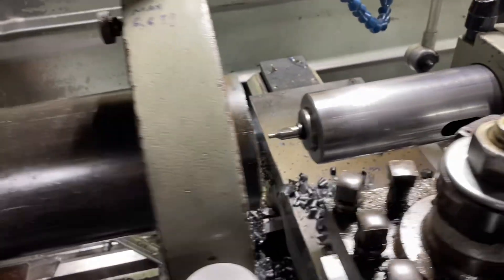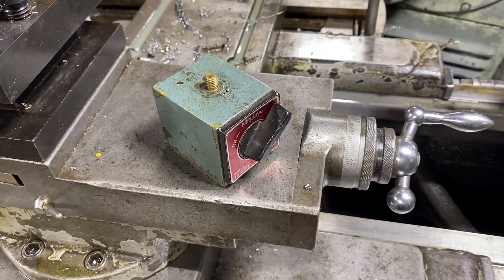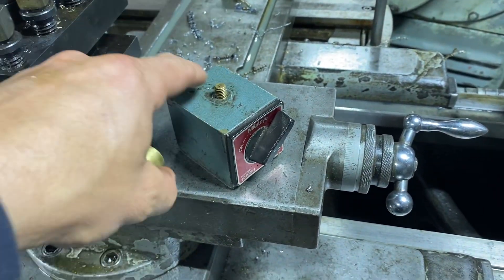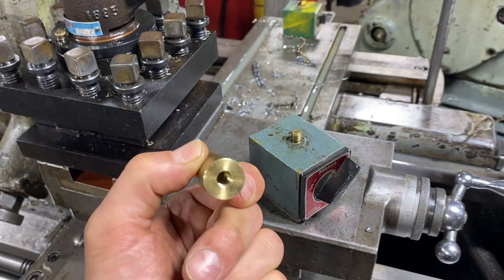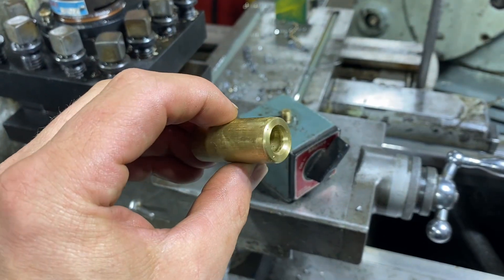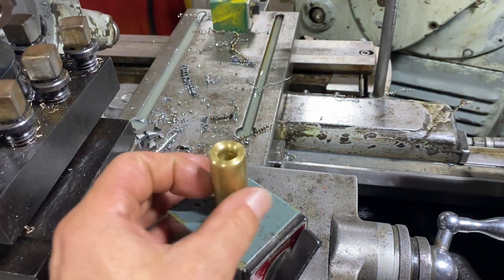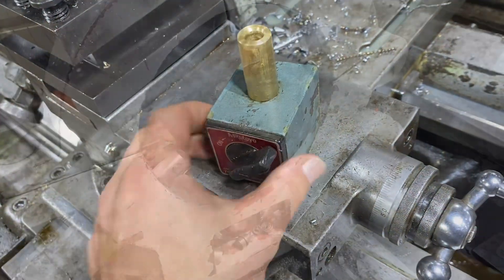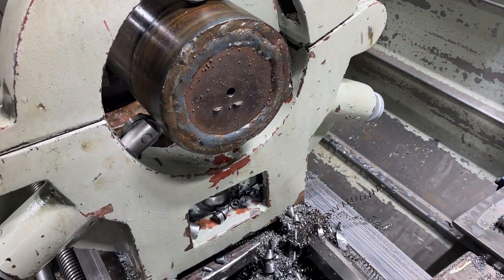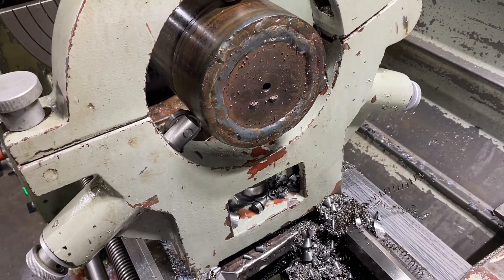The purpose of this video is how we can use a coaxial indicator — the same one that we use in the milling machine — in this circumstance. I've got an old magnetic indicator base here; I took the stud off it, and what remains is a brass pin that is M8 by 1.25 millimeters. We've made a little brass adapter that goes M8 to 10 millimeters to accept the coaxial indicator. A set screw crossways through the 10mm side was considered but turns out it's not even required right now, so just ignore that hole.